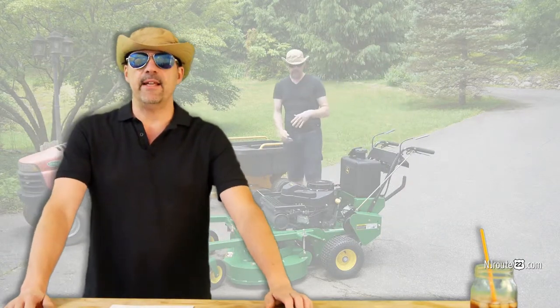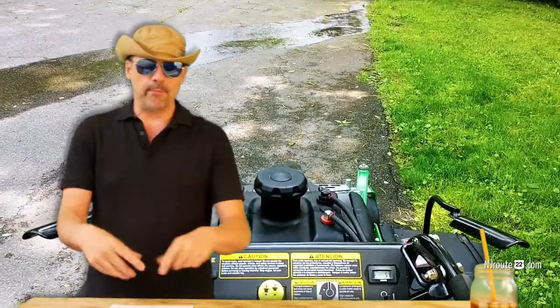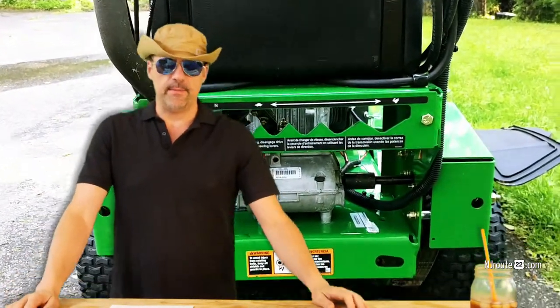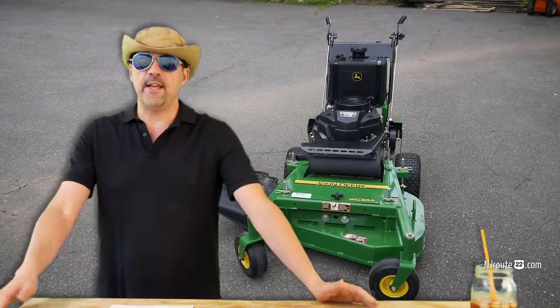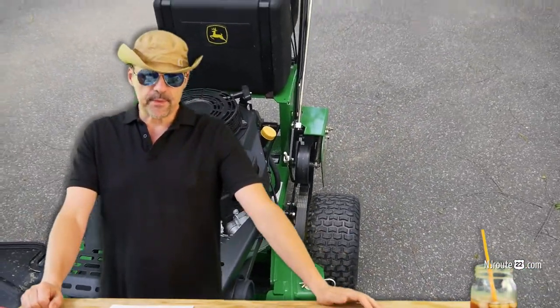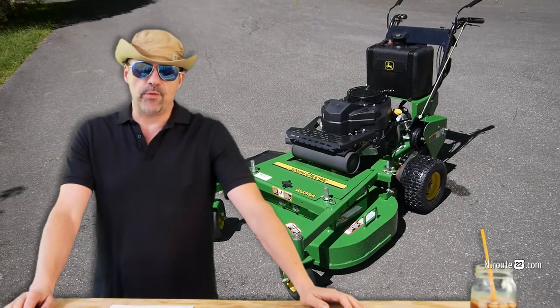It stands for walk-behind gear, 36 inches, and so on. But after using it on our property — we have a lot of hills — we were extremely remorseful for buying it. A gear drive model basically has one motor in the back with two gears, and you use the handles to engage and disengage the belt that attaches to the motor. That powers the lawn mower; you're basically releasing power and the belt slips, and that's how you steer it. It's a real pain in the neck because there wasn't as much control, especially when you release the springs. If the belts get wet, it gets even harder to control, and we found the wheels would skid and tear up the turf.